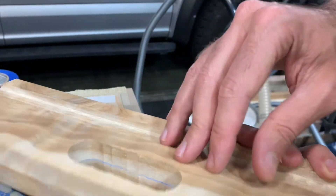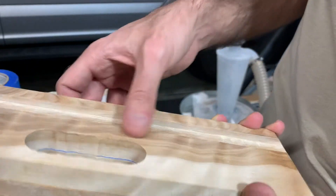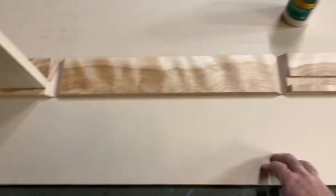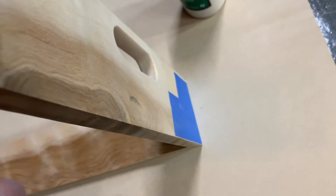I put the pieces back to back with double-sided tape — same double-sided tape — which makes it a little easier so I don't have to come back and do a whole other pass. I got all the angles cut using a piece of MDF underneath, and I got the blue tape on to hold these corners in place as I sort of roll it up.